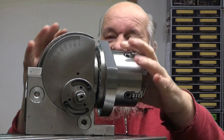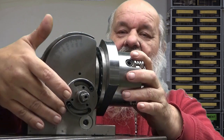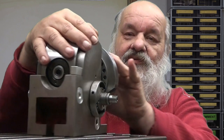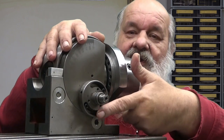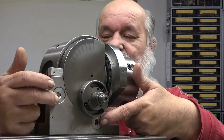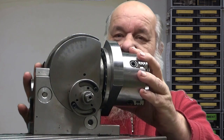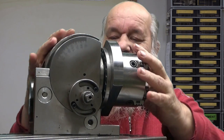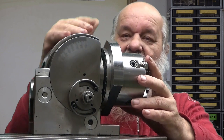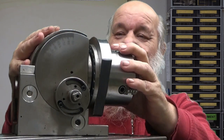Well, and then this rotating platform can be tilted. As you can see, we have here two locking bolts which go to this side, like here and here. And when you tighten these, it will lock this in place. When you loosen these, you can tilt it whichever way, 90 degrees, so that it points directly up, for example. That's about the platform.